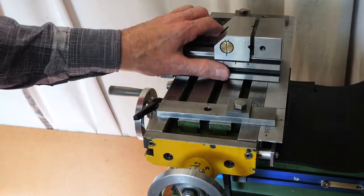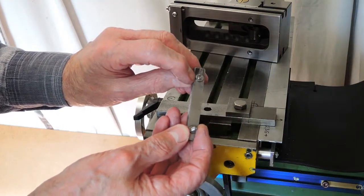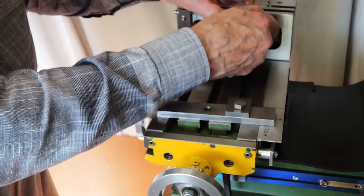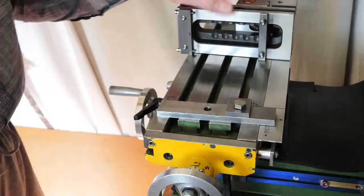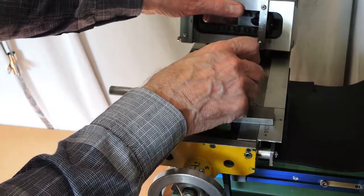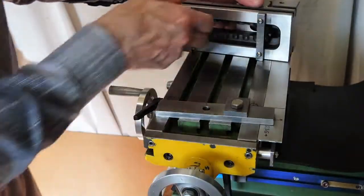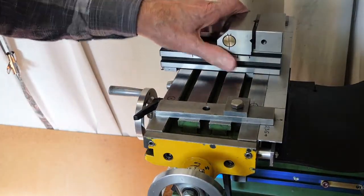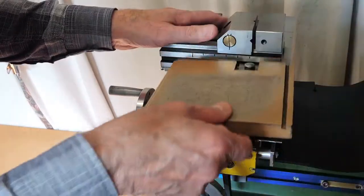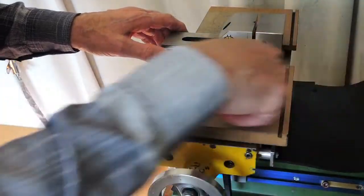After a while I decided I wanted something better, so I made another bar with some locating discs. I drilled holes in the bottom of the vise with a tungsten drill and then made an insert with a thread glued in. Now when you put that on they're very firmly in position. You bring up the clamps, add a little cover, and there's no movement at all. Then you tighten that.